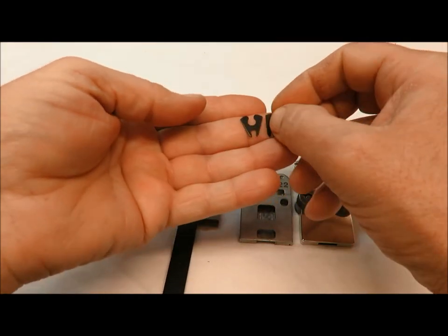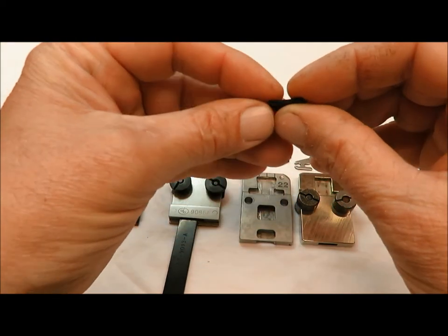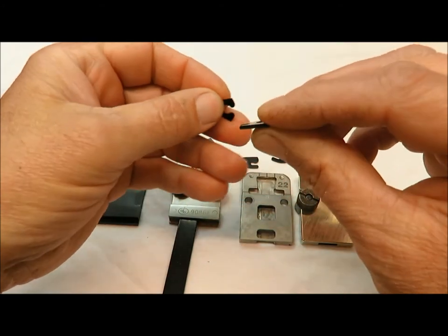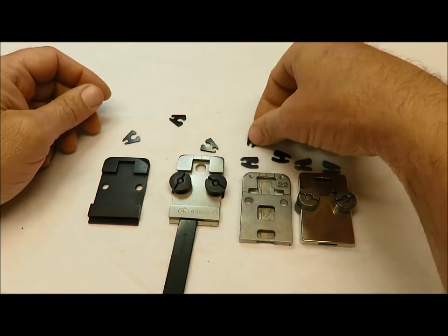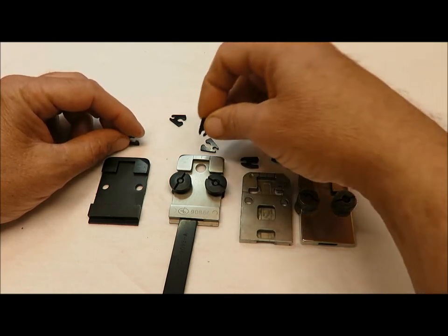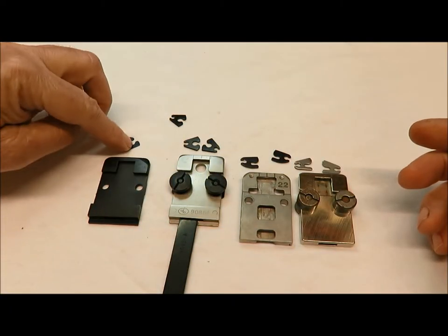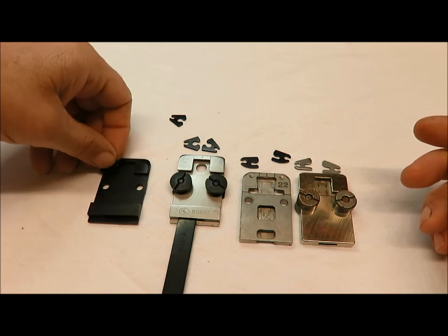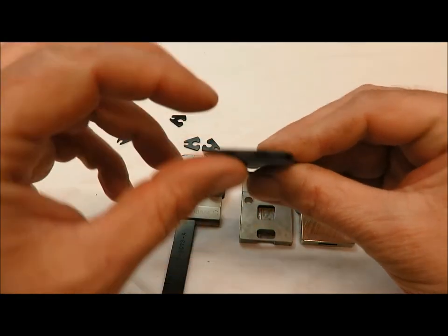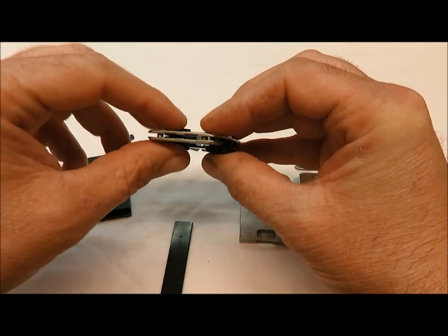For Acme, Boss Stitch, and Deluxe, there are basically two clincher points — the difference is thickness: a thin one and a thick one. The thick one is about the thickness of a dime, so you can lay your clincher point next to a dime to check. The thin one is about 1/32 of an inch thick. The thin one will fit in both bases but will only work in a base made for it — in a base with a thick groove it's too sloppy and the wire will jam.